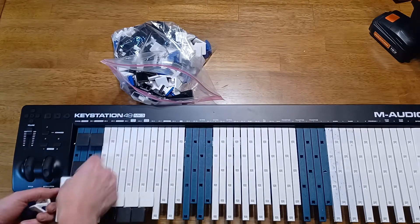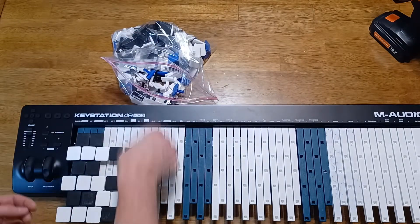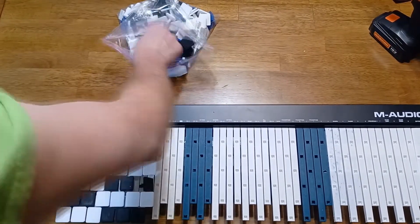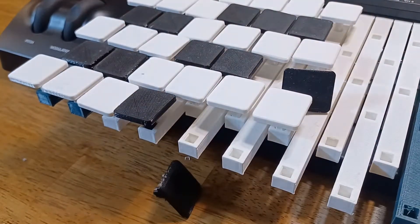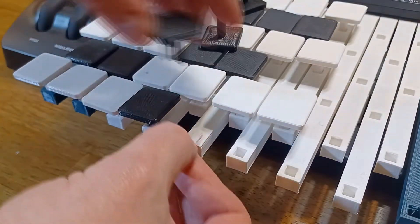Adding or changing the key tops means I had to put holes in the keys that match up with the pegs on the key tops. What I learned quickly about 3D printing is that the size of the things printed varies enough that it requires another layer of problem solving. Both the holes and pegs vary in size on both sides, so the variation of fit for a key and key top is four times the error bars in printing size. They have to be tight enough to not fall out when playing, but loose enough to remove and swap out. Since printing pegs too big doesn't work, and printing them close to the right size results in tons of wasted parts, I printed them on the small side and came up with this high-tech solution: putting tape or paper in the hole to fill in the gap and add the needed friction.